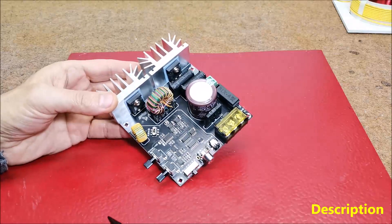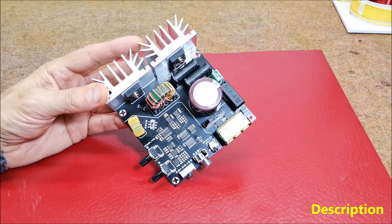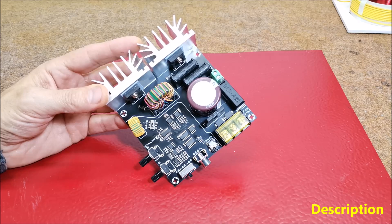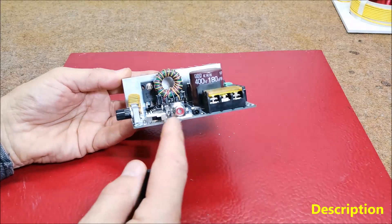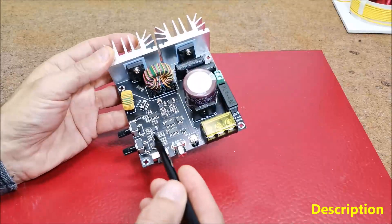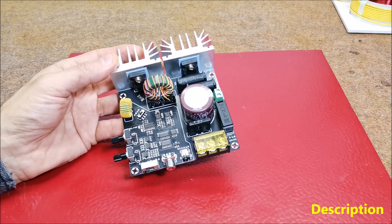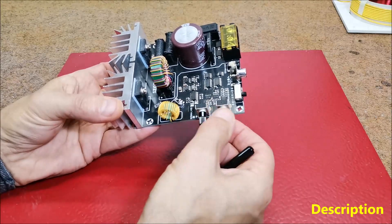Unlike the previously mentioned module, in this case SMD components are used, which reduce the required board space and cost, and also simplifies the manufacturing process. This low voltage part is powered by an external 12V DC source. This switch selects the operating mode between interruptor or audio modulated. The components used in that part are two 555 timer integrated circuits, LM393 comparator and 74HC14. With the two potentiometers, independent pulse width and frequency can be adjusted in interruptor mode.